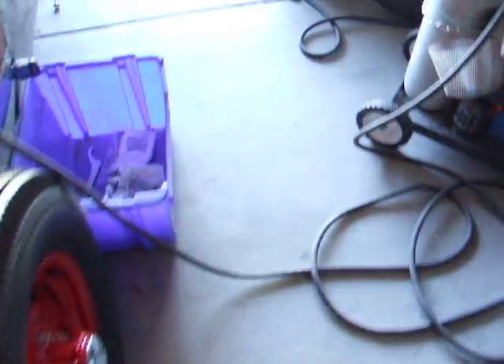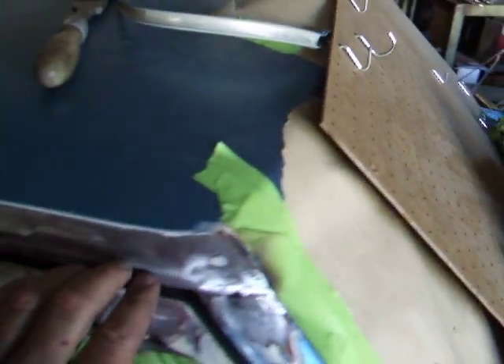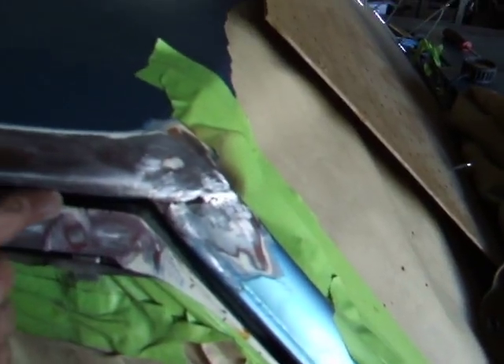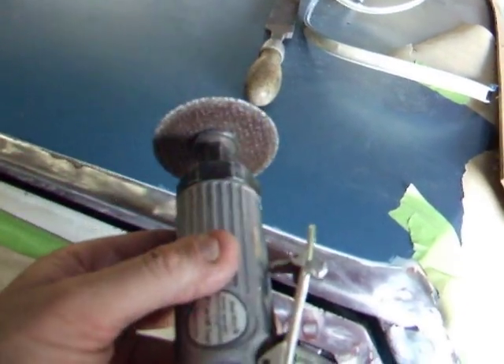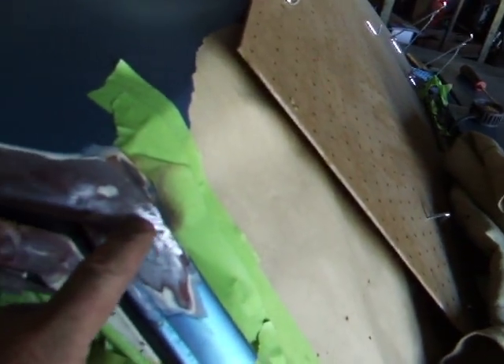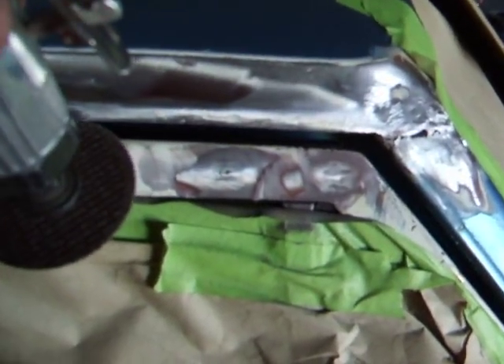It's quick and dirty, you only need a few tools. The trim came off this side with a screwdriver. That left the L-channel that came up. What I did is I took a cutoff wheel from Harbor Freight and proceeded to cut the entire drip rail off, not cutting into the actual body. Then I took a grinder and ground it smooth, then came back with the cutoff wheel and did a little bit of a gap right down at the bottom.